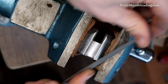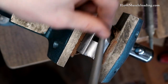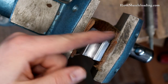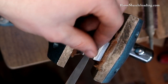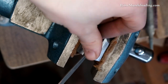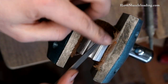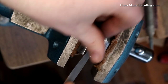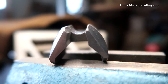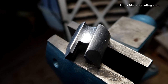So I'm going to come back in here, establish my chamfer on that curve while I have access to it right now. You can see there we have a nice kind of flat, even color as the light reflects off of that. Coming back in here, we're going to give this a little chamfer. A smaller half-round or round file might be a little bit better right here — you can probably be a little more aggressive with a smaller diameter or smaller radius. And that cleans up kind of where we've muddied out that edge. A lot of this stuff, you'll hear: it's not about being perfect, it's just about hiding your mistakes.